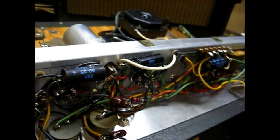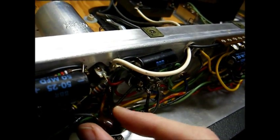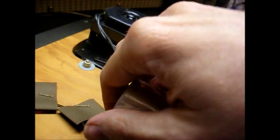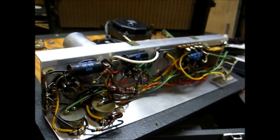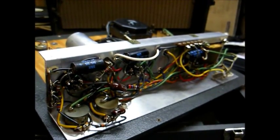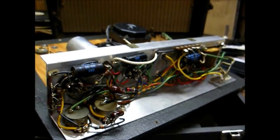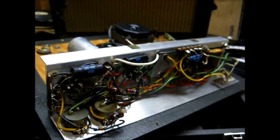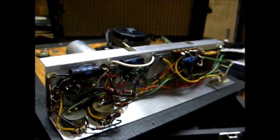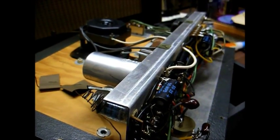And there's the underside of the chassis. Really not a whole lot to it in the way of capacitors. There's these three electrolytic capacitors and this one brown drop cap, which is probably still okay, actually. And this can electrolytic capacitor that's probably still good. This particular machine was made until approximately 1968 when the solid-state machines came out — I think from around 1965 until 1968. There was an older two-speed machine made probably from the late 50s up until 1964 or so that used basically the same amplifier.